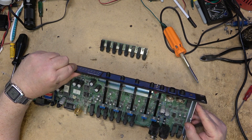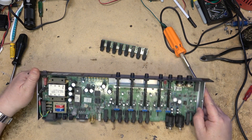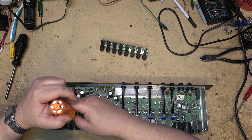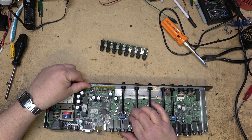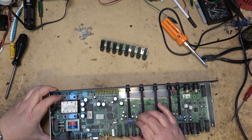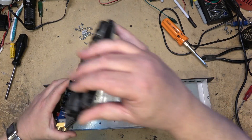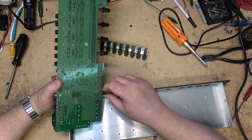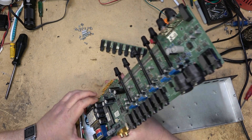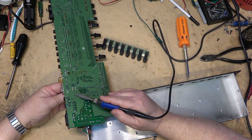I'm sure I'm missing one or two screws here. There's one more over here holding the regulator down. Now the whole thing should lift out to the point where I can get at least far enough to reach the capacitor I need to change. There we go — looks like someone's done some mod work down here; they put a couple of diodes on the bottom. But this cap is bad, so we'll take this one out.